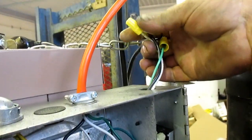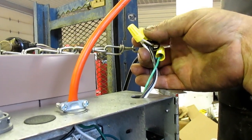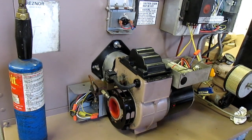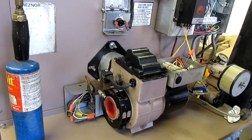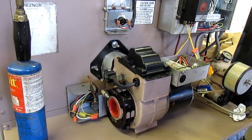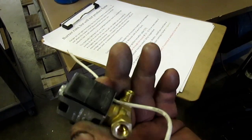Some important factors: turn on your circuit breaker and allow incoming power for seven to fifteen minutes. Some furnaces take up to thirty minutes to warm up all the oil preheaters before you try to fire it, because cold oil won't burn. During any trial for ignition — hereafter called TFI — air must whistle through the nozzle at twelve to fifteen PSI on most models. If not, the air solenoid may be rusted, dirty, or inoperative.